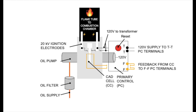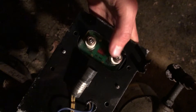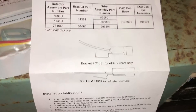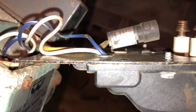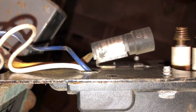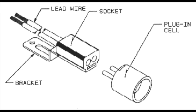To replace the CAD cell, you will need to open up the housing. Loosen this nut and this nut so that you can slide the burner open. There are two electrodes and one CAD cell. You can order the Beckett part number from the description in the link below. Depending on the burner you have, there's a different mounting. For the part shown, the eye was bad, so I ordered a new eye. As shown in the Beckett diagram, I simply removed the old eye and snapped in the new eye, and that solved the problem.